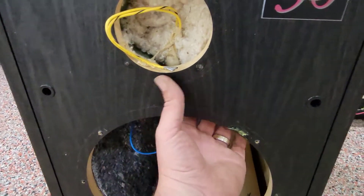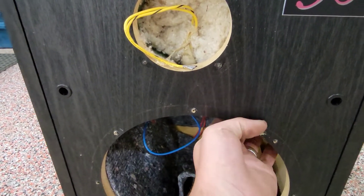That missing second brace might have helped prevent this, because this is the one that came loose. That's going to about do it for this video. I'm going to get to work on these RE30s — get that brace glued back — and I'm probably going to add another one in so it'll be just like the VS120 cabinet with two braces on the side, which should help stiffen it up and prevent that from happening in the future. I'm also going to work on the VS120s fixing the stripped screw holes for the woofer. Remember: Cerwin Vegas, big or small — save them all.